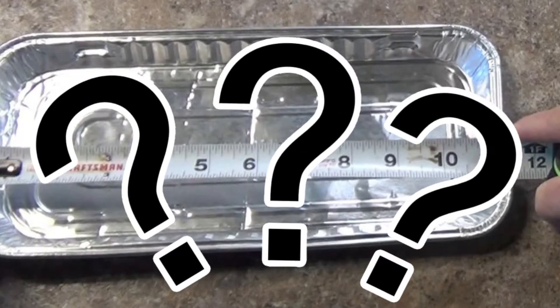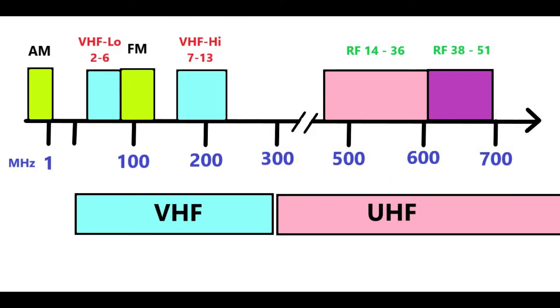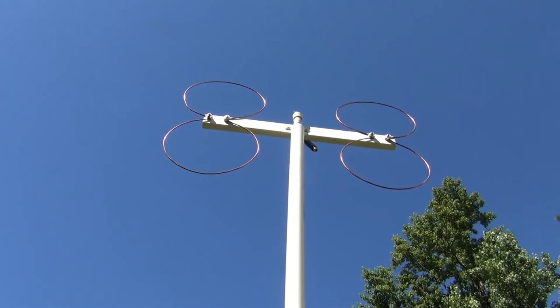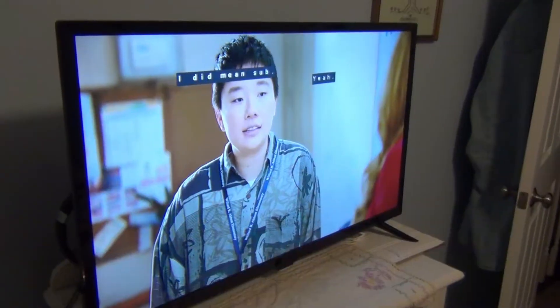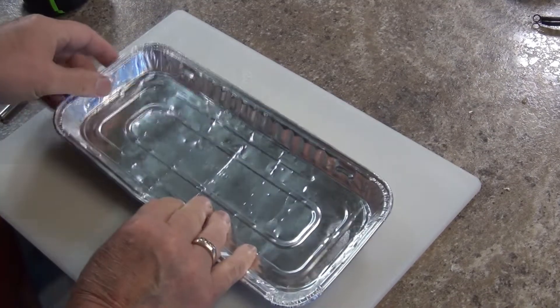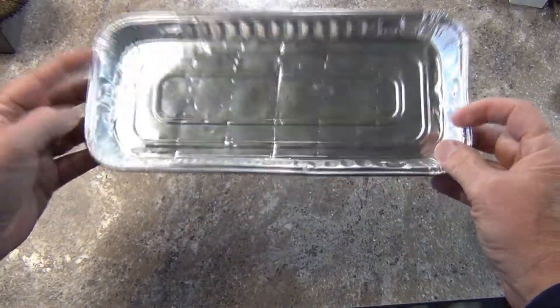I can see some of you are wondering why this measurement is so important, so let me briefly explain. Antennas have to be tuned for the frequencies you want them to receive. The pan's dimensions will determine if I'm close to the proper dimensions a properly sized antenna would be. Normally, I make hoop antennas with a diameter between 7 and 9½ inches, giving a circumference of between 22 and 29¾ inches. These dimensions work well for receiving the UHF stations in my area. This danish pan has a corresponding perimeter measurement of about 34 inches, which is larger than I normally use, so I'm not exactly sure how well this is going to work out.